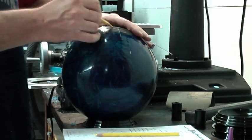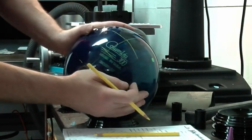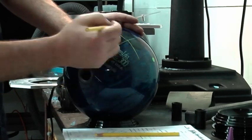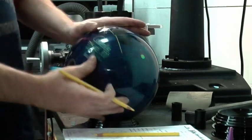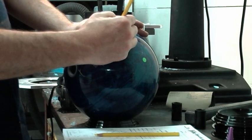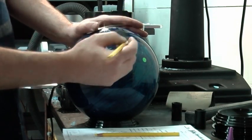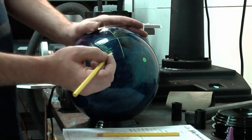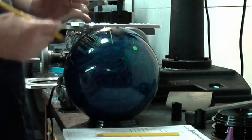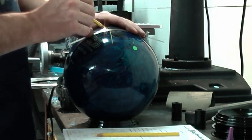Again, I'm going to use nice broad strokes so you can see it. You can see how the arc swings down on both sides instead of going straight across, because the edge of the drill bit is going to hit here. The tip will be back here, but the edge will hit here. If I only come straight across, the span's going to be too long. Now the other line I need to put on here is a 1/4 inch bridge.